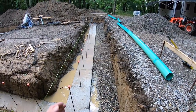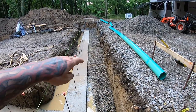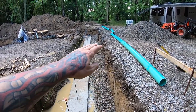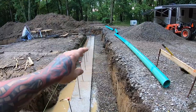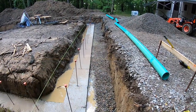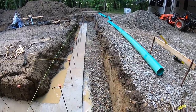A French drain or drainage tile is a way to get outside water away from your foundation. It's not just in case you've got water trying to get through your walls and into the basement — it's also what's called hydrostatic pressure. If you backfill all of this with stone, or some cheaper builders would just use native soil — which is not recommended — that soil is going to compact, water's not going to get through it quickly, and it's not going to get down in there and take it away. So if you use stone, it's going to travel a lot quicker through, get to your tile, get into your sump pump, and your sump pump will kick it back out and away from your foundation.